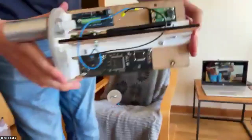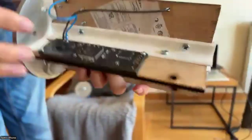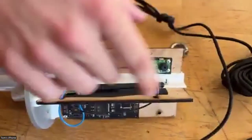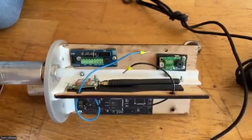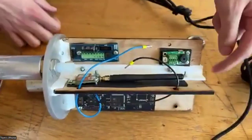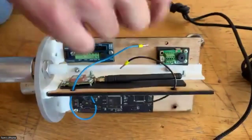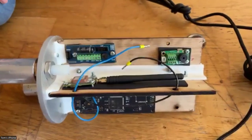So the electronics are mounted on 4 shelves throughout the bay. We have the main flight computers, the primary tracker, the ESRA flight computer. They are each on an individual board of plywood, 5mm thick plywood in here, which are screwed onto this central 3D printed mounting column. Effectively, when these screws are taken out, you can take each board off individually, and it's like a self-contained version of the system.